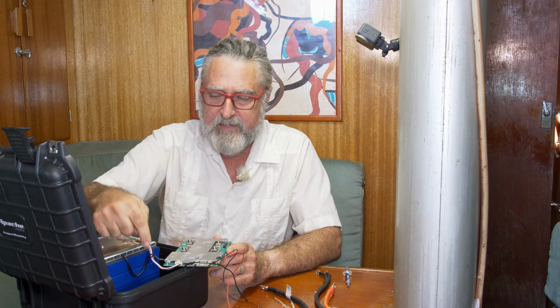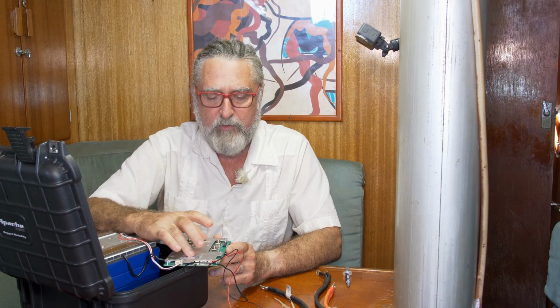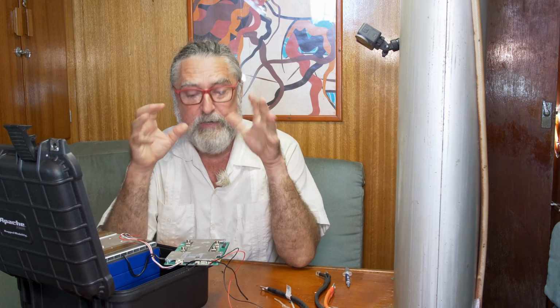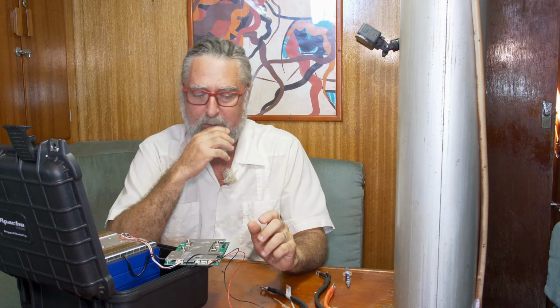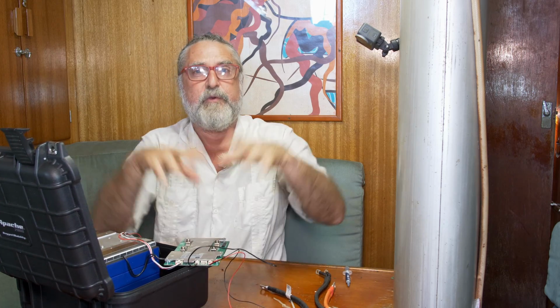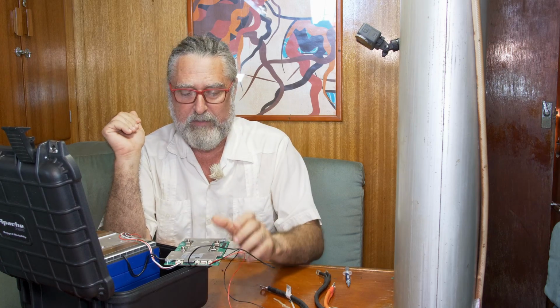The BMS itself has another thermal pickup inside it that can watch its own temperature. So if its transistors got too hot, it would shut itself down as well. So we have pretty good protection for temperature, including cold temperature. Please don't charge me anymore. This one is probably also used to transmit the temperature to the Bluetooth app. We have a Bluetooth app. That's pretty damn cool.